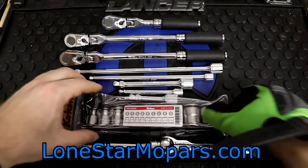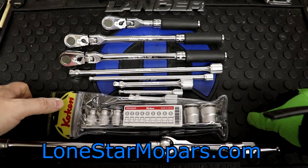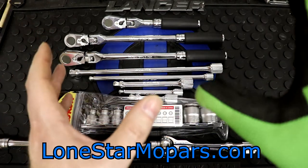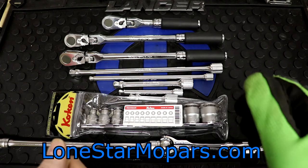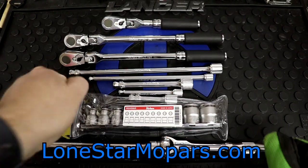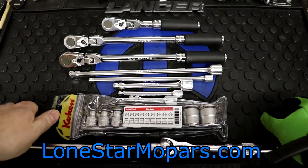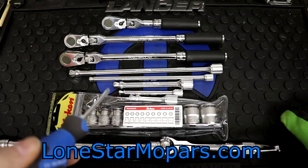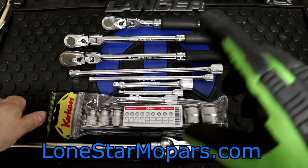This is going to be awesome. Obviously it pairs with the ratchet, and we can throw it on the Zeal as well. Those quarter nut grips get way more work at work for me than here at home. With junction boxes — weird things where you're trying to hold a cast piece plus a gasket plus keep wires back and start a bolt — they're awesome. In a typical scenario with a Klein nut driver, you're trying to keep it pointed up, but with junction boxes you kind of have to go down. The nut grip setup lets you have the fastener already in place and just stab it in — much nicer.